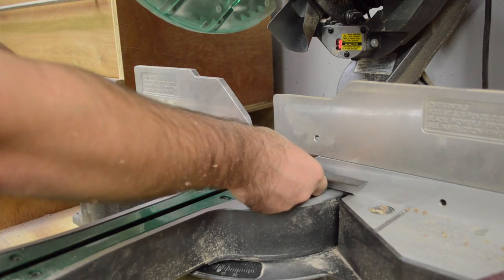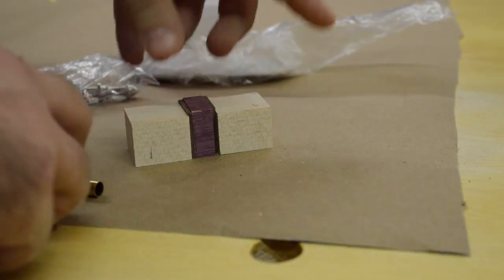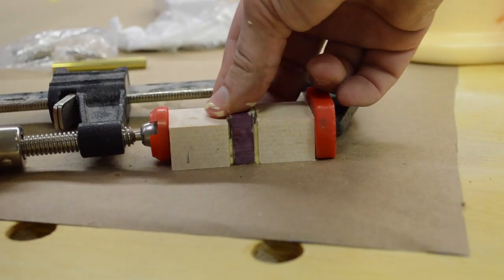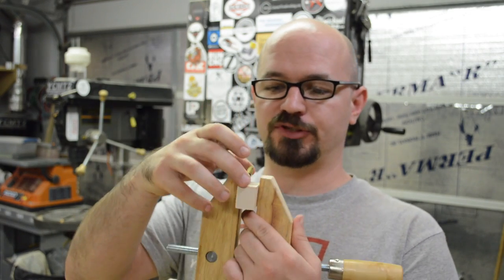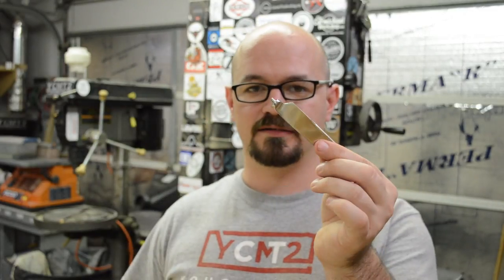With the board complete, I moved on to the matching cheese knife. I use some off-cuts and lay out a pattern similar to the board pattern so they kind of match. I glue these together with regular wood glue — it's not too important that everything be square because I'm going to turn it round anyway. I've got my knife blank clamped so I can drill a hole for the tube. Once the tube is in, I can turn it to shape, then glue in the two small pieces — one of which is threaded so I can screw the blade onto the end.